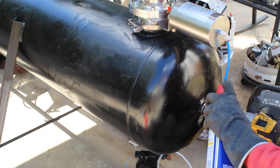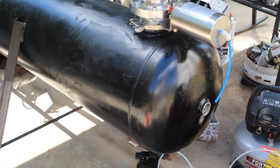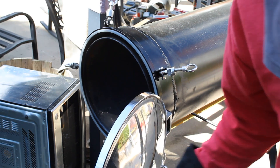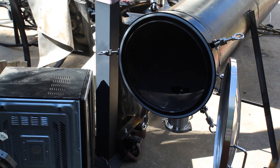I had to make the hole bigger because that was a three-quarter-inch pipe before and I'm using a one-inch shaft, so I had to expand the hole to a little over one inch inner diameter. I did that with a good old step drill. Now look at it — we've got the manway on, standing up on the wheels, looking real nice.